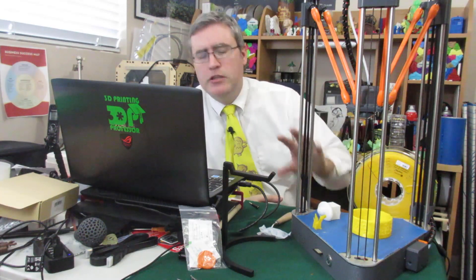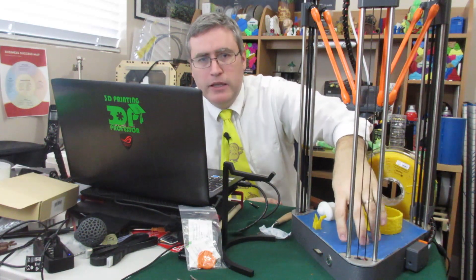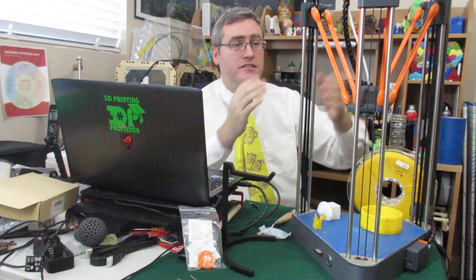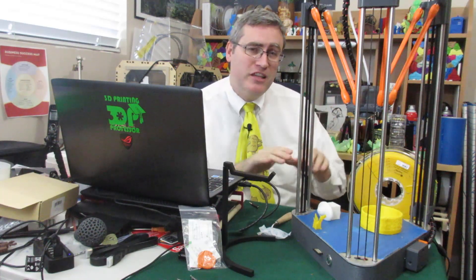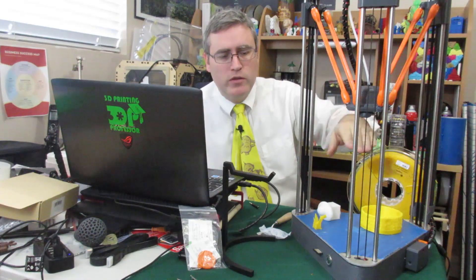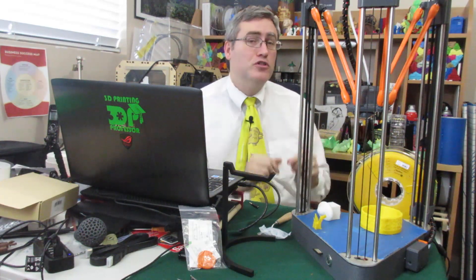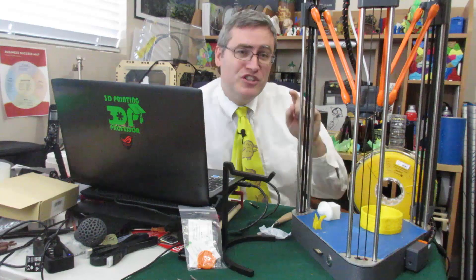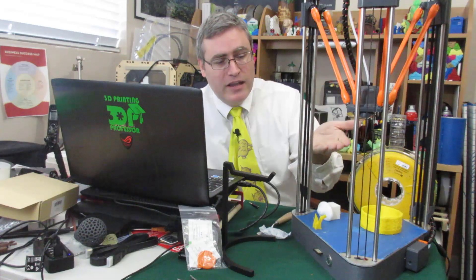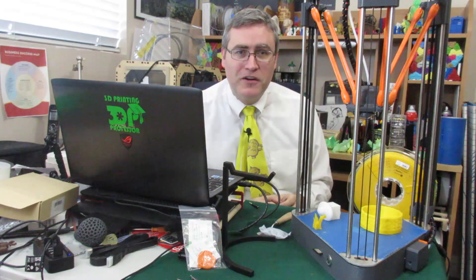It's also a simple 3D printer — it only has a button you touch and a build plate you can tap on. This is a Delta 3D printer, meaning the build plate is stationary, but you still need to level the nozzle. Their solution is super clever: they put switches on the build plate so it can detect when it's being depressed. When it levels, it comes down and touches the build plate, the plate senses the contact, and that establishes their interaction point.